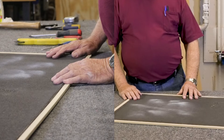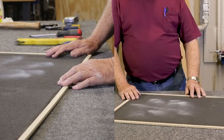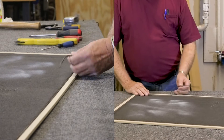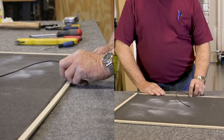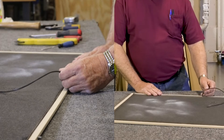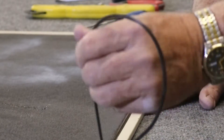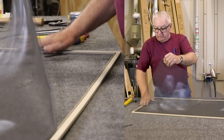All right, we are ready to confront the patient. First we need to remove the spline. Pay attention to how the spline is removed — does it come out easily as if too small, or is it hard as if too large? Spline sizes can be altered to resolve these issues. Now just go ahead and remove the remainder of the spline. Once completed you can remove the fiberglass material.